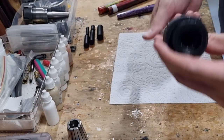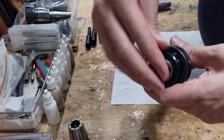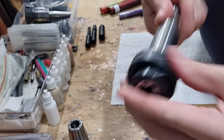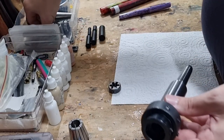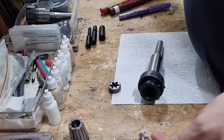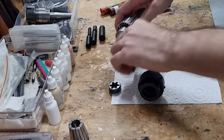The last thing you'll need is a sliding rotating die holder. This holds the dies so that you can cut external threads, with the holder supported in your tailstock and rotating freely — otherwise it won't work. The taps can also be held in this via an attachment, but it's very fiddly to swap. I prefer to hold taps in my Jacob's Chuck and have it sat loosely in the tailstock, which provides a straight section.